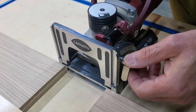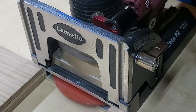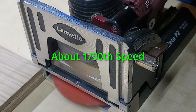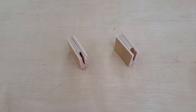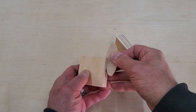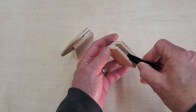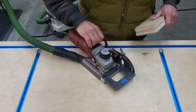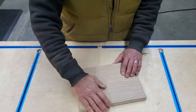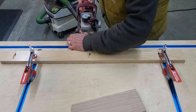As the cutter reaches its maximum depth, this trigger causes it to quickly oscillate up and down and create a T-slot at the bottom of the cut. I set this up to show that oscillation actually being triggered. Would have been fun with super slow-mo, but I'm only working with 60 frames per second. Did you see it? To wrap up the biscuit comparison, here are the two different slots cut in half and their corresponding fasteners being installed.